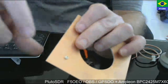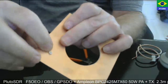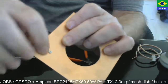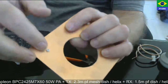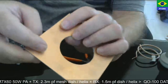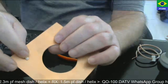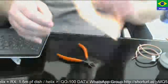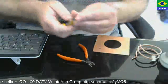I'm going to have to cut this Teflon side here because I need to start the helix very close to the copper. If I'm lucky, I won't need the tape coupler — on many helix builds I've made, I didn't need that tape to adjust the SWR. So I'm just going to cut this.